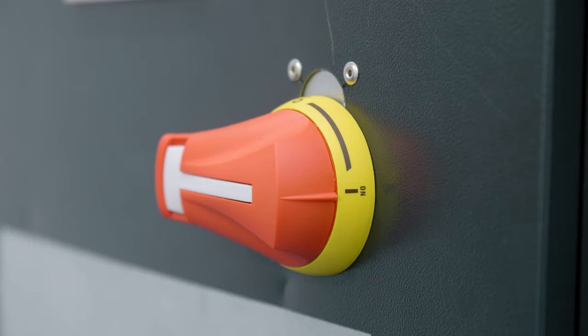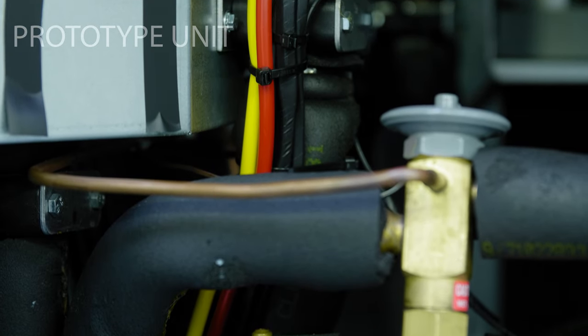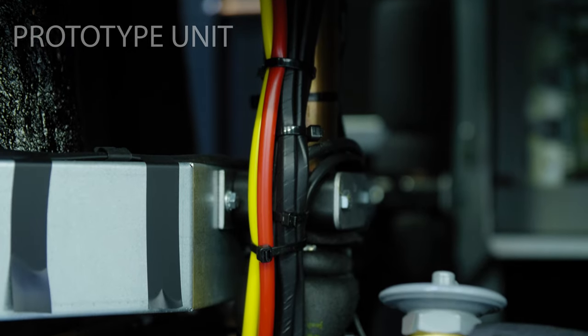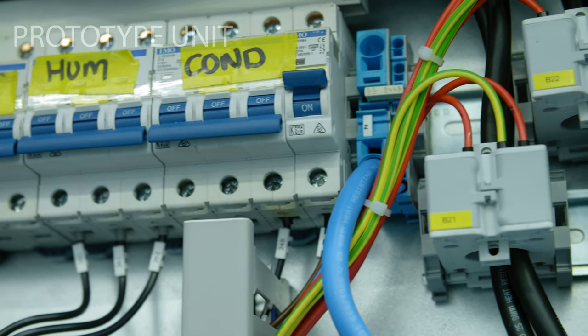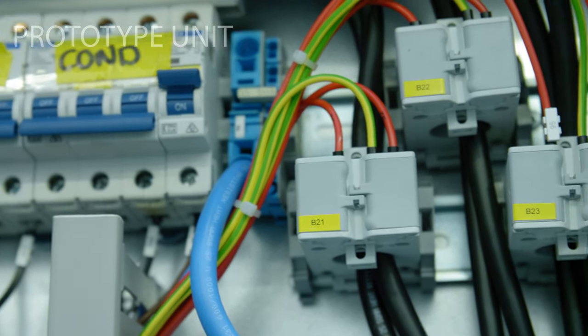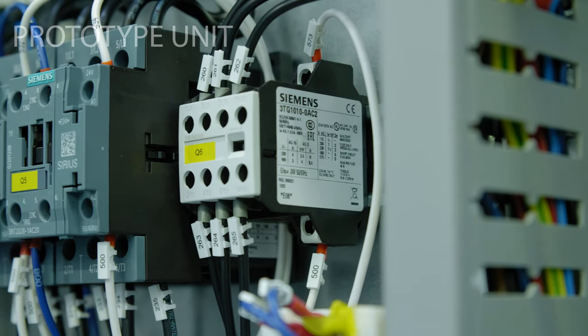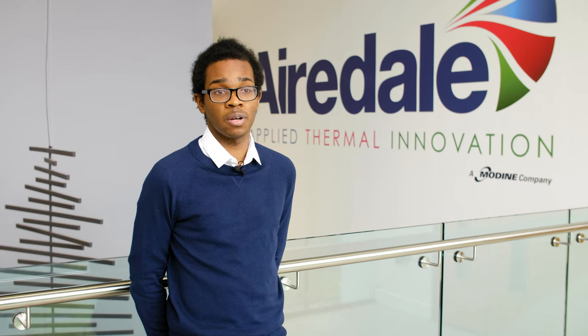As a design engineer, my role is to carry out the mechanical design and component selection. What I've really enjoyed was doing the compressor selection — upgrading our technology to the Copeland compressor, which uses a scroll type of compressor technology. We chose this because it offers full load efficiency gains compared to some of our other compressor manufacturers, and the operating envelope of the unit is quite wide by virtue of the compressor envelope.